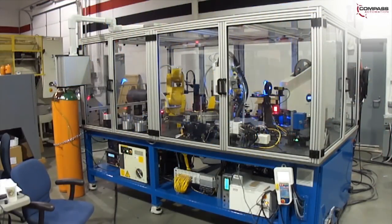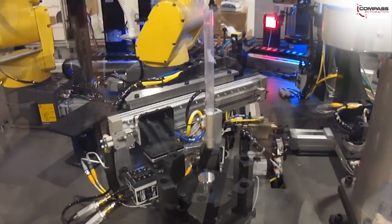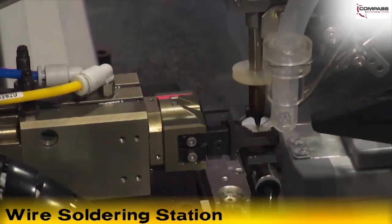Or the housing is moved to a reject location. A PZT is then retrieved by a slide-mounted gripper that advances in, grips the part, and retracts to a slide-mounted vacuum. The vacuum slide retrieves the part from the gripper and delivers it to the soldering station.